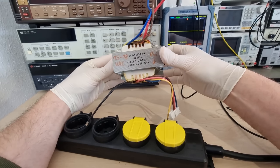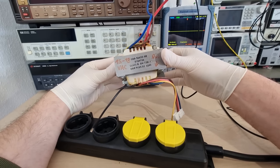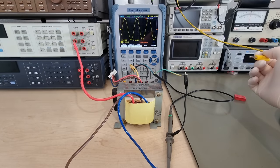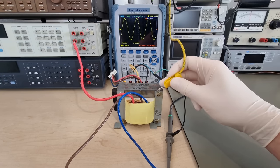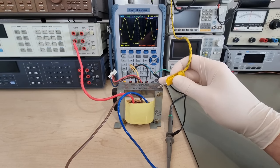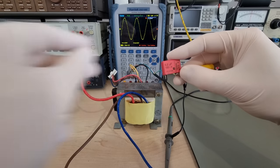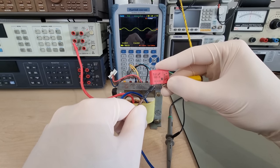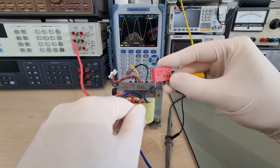Three more candidates before we get to the special delicacies. This is a random laminated EI core but not with split bobbins — the windings are smooshed right up against each other again, giving good coupling but not particularly extreme isolation. It's also a physically large chunk capable of delivering 100 W or two. Sure enough, it's not great for our purposes today. But the situation can possibly be salvaged: the core can be grounded, taking it out of the capacitive coupling equation mostly, and the remaining interwinding leakage can be shunted to earth with a capacitor. This is only a countermeasure for very bad situations — if you've got a cleaner transformer, this can backfire and make things worse.